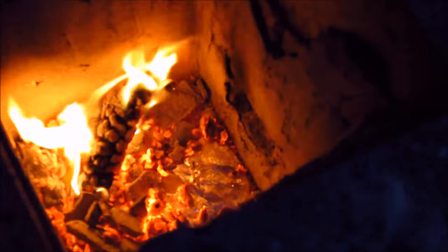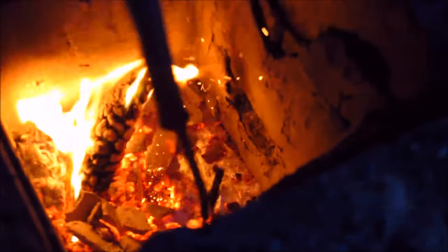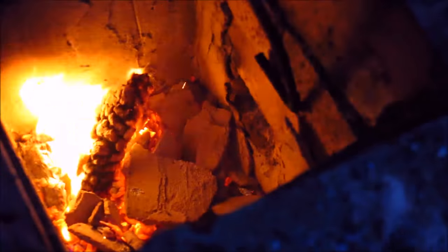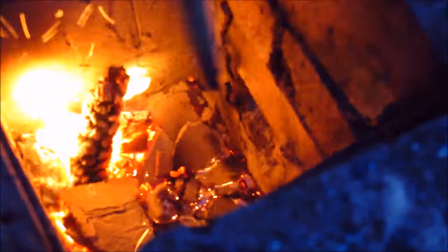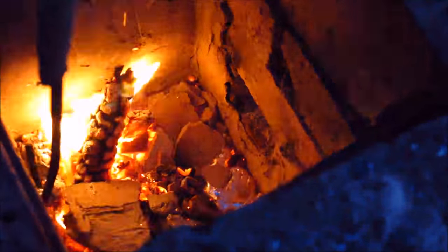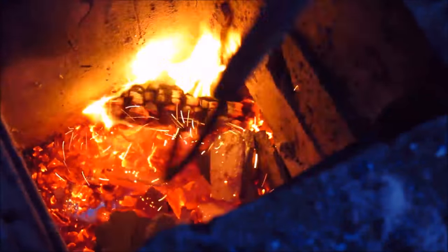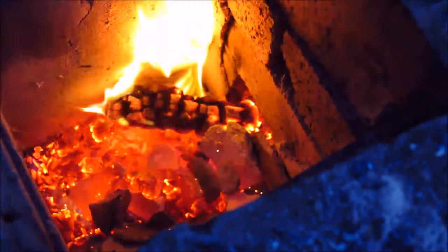I give you value, viewers — there's always an extra bit at the end. Here you might be able to see that the aluminium that I put in is quite molten. A lot of my clay has flaked off — that's not been as good as I hoped. But at any rate, it does work. It could probably work as a scrapping furnace — I thought I might be able to put some sort of a pan on the bottom with a drain and just throw things in, but my old oil drums work pretty well too, so I'll go back to that. Interesting to see how all the other material is floating on top of the aluminium.